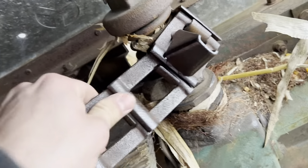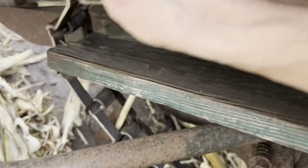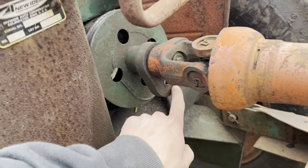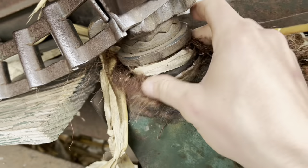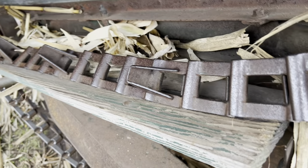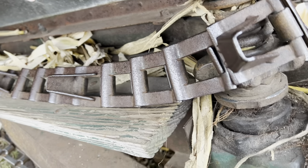I found the problem - chains came off the sprocket. You can see it's supposed to be on this one down here, so it's dangling down and it just got bound up. Rather than the slip clutch just hammering, for some reason it broke the shear bolt that goes in there. But that's not a big problem - just take this chain apart, get it wrapped back around there, maybe tighten it up a little bit, put a half link in or take a link out and put a half link in, or whatever we need to do. Or maybe it'll just go back on there and be fine for another year of picking. Then put a new shear bolt in and we'll be good to go.